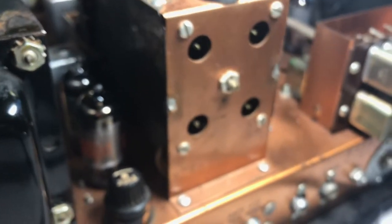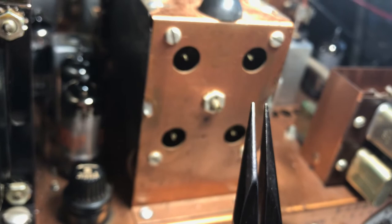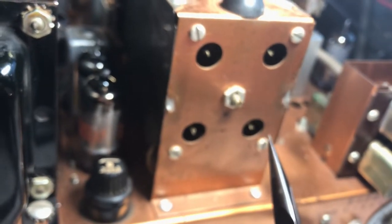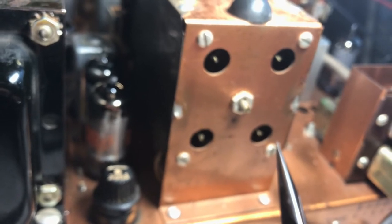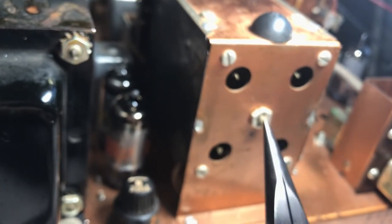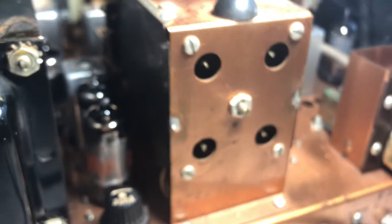To fix that you have to tweak all four of these slugs. I just use needle nose pliers — you can just turn these a quarter of a turn, that's all you need, grasping each one gently. When I was rotating for maximum voltage, I could see they needed to go out toward the back. So I went about a quarter clockwise on each of these, and that's all it took to bring this up to a high negative voltage — clocking in at about minus three point something.